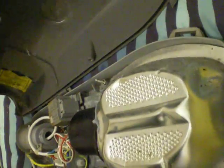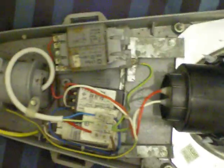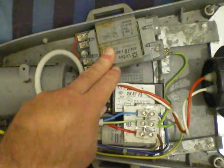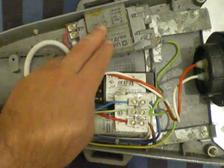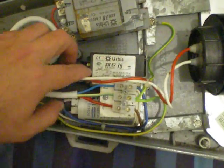This is inside the fitting. Here you have a ballast — it's a 70-watt ballast. I have run 80-watt mercury lamps on this ballast and it works quite well. This is the igniter — this little black box is the igniter.